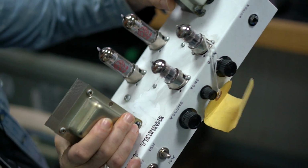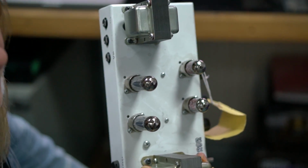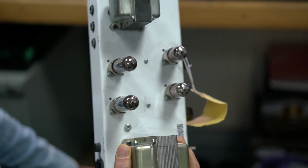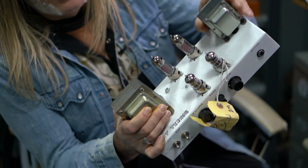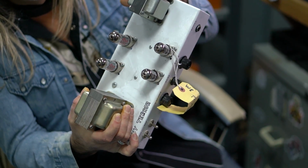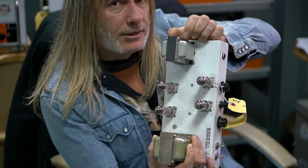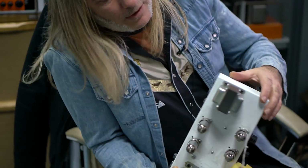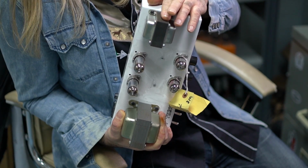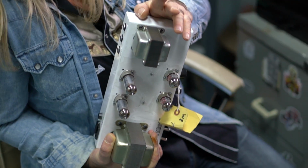I think we ended up with a little more stack on the, obviously when these originally went to Korea to be made, the first 2,000 or 3,000 were made in Korea to this design. I mean everything, all the turns, the interleaving in the output transformer was the same as this. So I think we ended up with a little more stack on the Chinese and Korean ones. But the actual turns, the wire gauges, the layers and the interleaving, it's a 5-section. It's like a miniature classic vintage 50-watt output transformer, but a 15-watt output transformer.